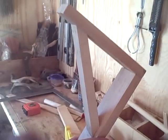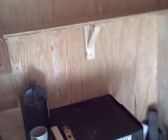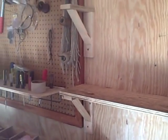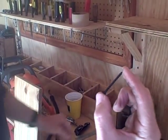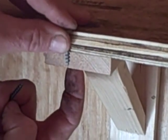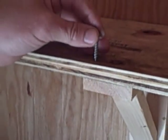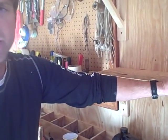That's how you get your 45s. Now we've got the bracket made. Once the bracket is made, we're going to go ahead and hang it. I already have one over there — let's walk over here. I've just got one screw. I'm using coarse drywall screws — that's an inch and a quarter drywall screw. And then I'm going to use a 7/8-inch decking screw for the top. You want to make sure that your screw does not go all the way through the board you're screwing into on the bottom. You don't want it sticking out on the bottom — one, it's obviously dangerous, and the second reason is that it actually makes it weaker. You want it to stay embedded in the wood.